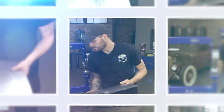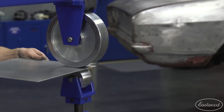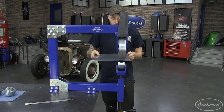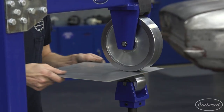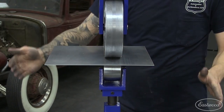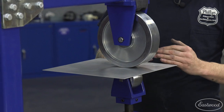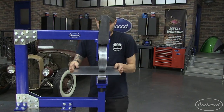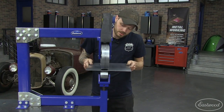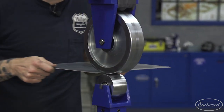We'll do a quick demonstration. What holds the crown in a panel is the tension around the edges. So when you wheel your panel with a steel upper and a steel lower, what's happening is the panel will create shape and stretch side to side, the same shape as the lower wheel. You will get less shape, but you will still get contour front to back. The more you wheel, the more stretch you're getting. Avoiding the edges makes the edges shorter — the center is now longer, and the metal has nowhere to go but to rise up.